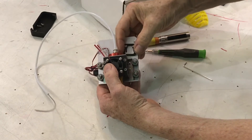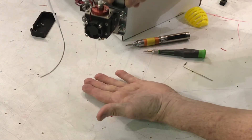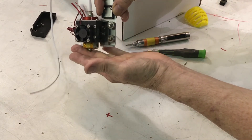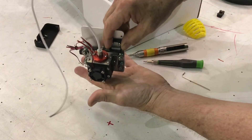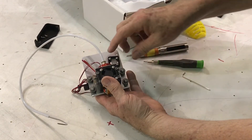This slot here is for your end switch for your CR10. You mount your end switch in here, and as your Z comes down to touch off you can see it hits the end switch in there. That tells the controller you've hit the build plate. You set an offset in there — there's another video on how to do that.